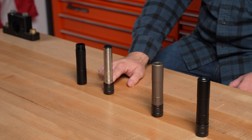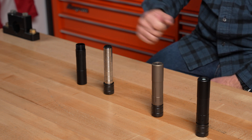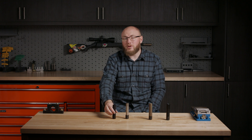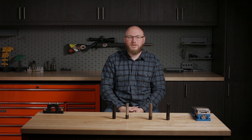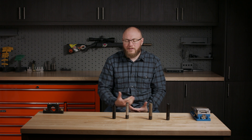Construction on this: your main serialized part — that housing — is going to be 17-4 stainless. Your entire baffle stack is 17-4 stainless, and your outer sleeve and end cap are made from aluminum. The reason we use 17-4 stainless on all the internal components is to allow for easy cleaning. You can put 17-4 stainless baffles in an ultrasonic cleaner, as well as use some pretty harsh solvents, and it's not going to damage your baffles.